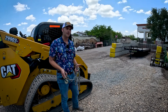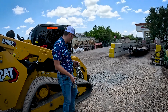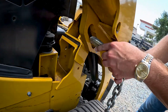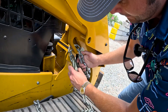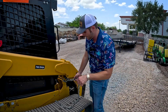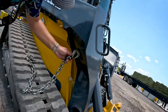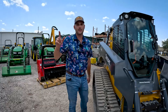Now, whenever you go to transport the Caterpillar, it's not as easy as the Deere. They did give you some nice big tie-down points in the boom, but you can't hook your hook directly to it — you've got to feed your hook through there and hook it to itself. That's not too difficult, but it could be better. On the John Deere, here's your hook right here — see these pockets right there? Doesn't get much easier than that. You just tie it right down to your trailer and onto the next job.